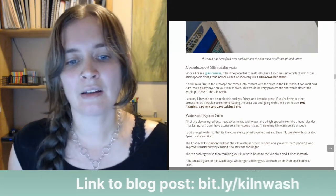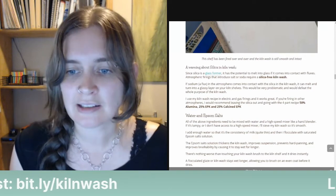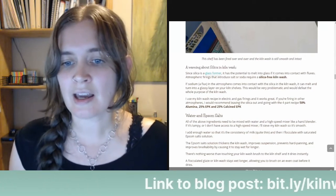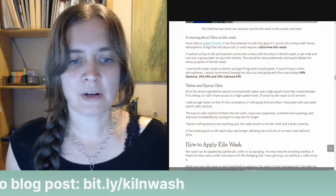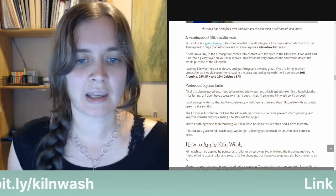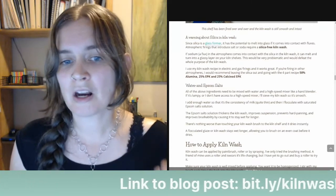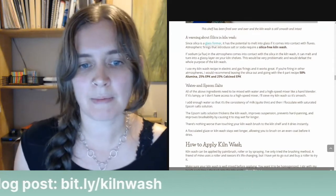I use my kiln wash recipe in electric and gas firings, and it works great. If you're firing in other atmospheres, I would recommend leaving the silica out and going with the 4-part recipe, which is 50% alumina, 25% EPK, and 25% calcined EPK, or 2 parts alumina, 1 part EPK, and 1 part calcined EPK.